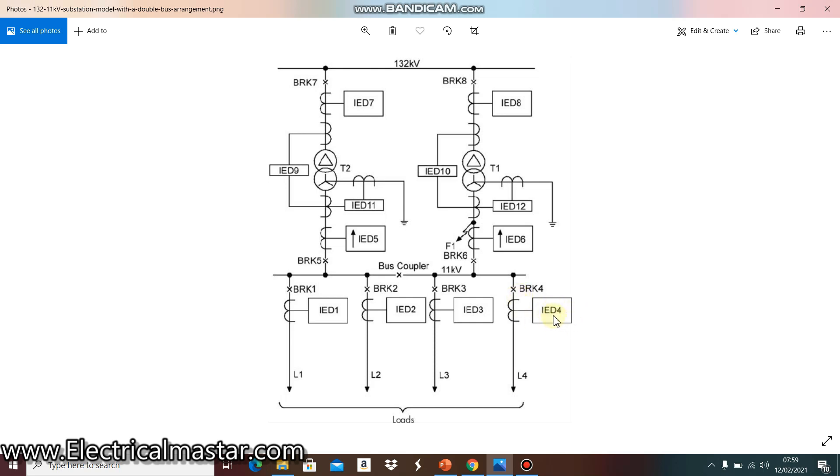All outgoing breakers are connected with control supply via the RCP panel. Through the RCP panel relays, you can handle breaker open and close operations. It senses current and voltage through the CT and PT and gives commands to open or close the particular outgoing feeders from the 11 kV bus. That is the purpose of the RCP panel. Thank you so much for watching this video.